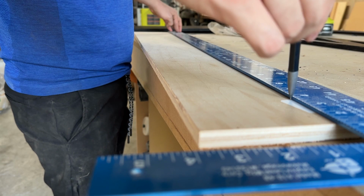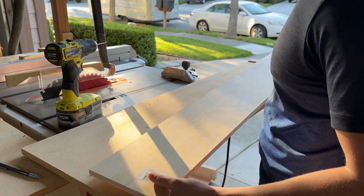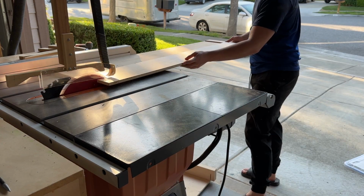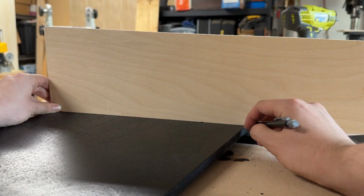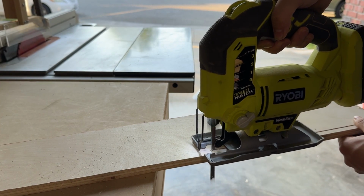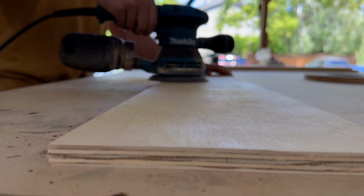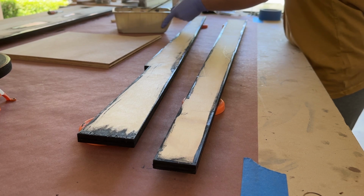My new plan was to build a box around the centerpiece, which would hopefully resist the rotational force and keep everything in line. The construction of this was very similar to before: cut out some trapezoids, notching a little bit to have everything flush, then a quick sanding and paint job before I could sand the paint off where the joints would be, and then some glue and screws, and everything was assembled.